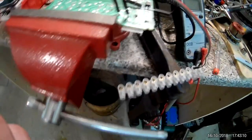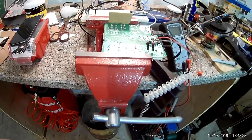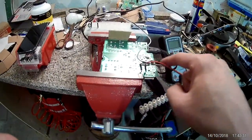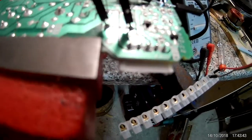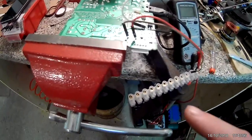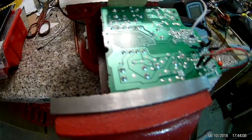What happened is when I cranked up the pot, nothing happened at first. I don't know how it compensates, but nothing happened — unless there's some default voltage. I think there's about one volt over it in standby. At some point when I crank this up, it rapidly starts to increase the voltage, and when I overdo it by just tiny amounts, this thing gets very hot and goes into thermal shutdown. You can hear it doing switching noises — the high frequency — and then it shuts down.